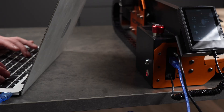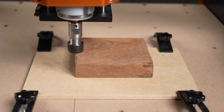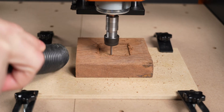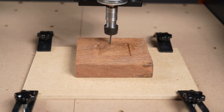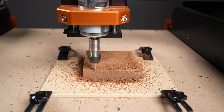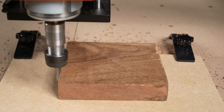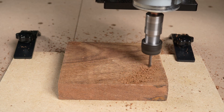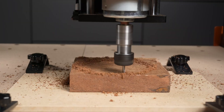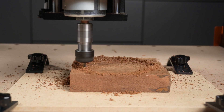For the test, I'm using a piece of hardwood with some nice grain. The surface was a little uneven, so I started with a 3 mm upcut bit, clearing a 2 mm pass to level it. The machine handled it easily. Next, I began cutting the inlay for my coaster project, starting with the same bit for the outline. I don't cut all the way through though, as it will be easier to trim the back off on the bandsaw later. A simple cut and the inlay will fall right out of the board.